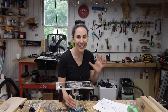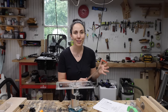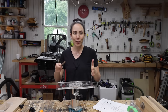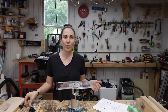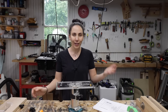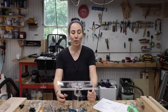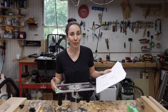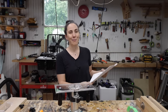That about covers what's included in the kit, but here are some other things you could do. If you want to make grooves that are equally spaced apart, you can make custom pieces that are the same size as your router bits and attach them onto the base — then put this into the already cut grooves and your next grooves will be equally spaced apart. Or if you want to cut circles larger than what the extension arms can cut, you can make your own custom pieces. The base with the holes is already there, so you have a solid foundation to work with to add on attachments and jigs. The instructions will be emailed to you after purchase, so check your spam box for that.